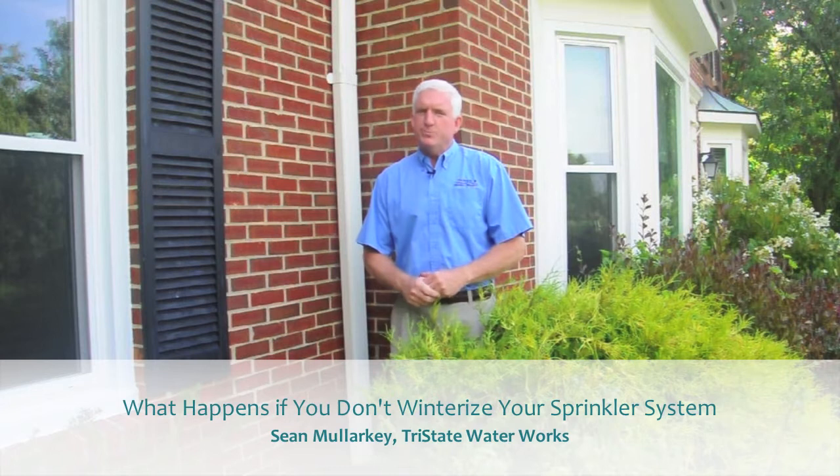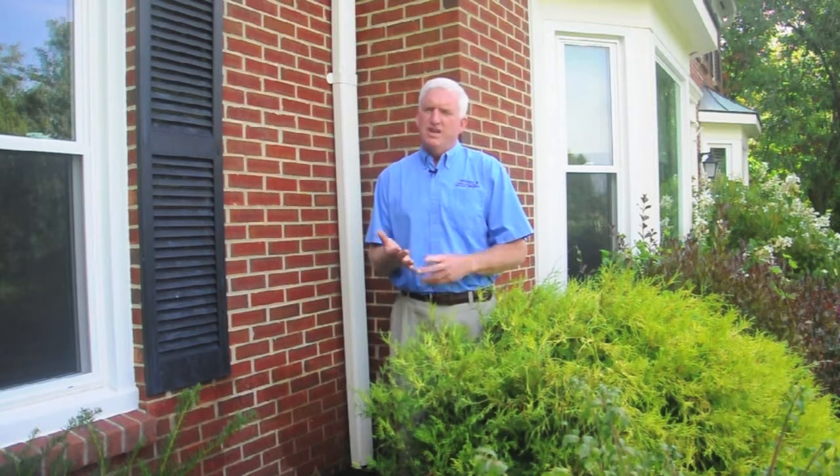Well, it's August, but pretty soon we're going to be winterizing sprinkler systems. And why do we winterize sprinkler systems? It's to protect your investment. On a cold night, even in early autumn, I've seen it happen as early as the 1st of November, we get a night where it dips down to 24, 23 degrees. You can freeze the exposed components of your irrigation system. So the first thing it would freeze would be the backflow. I'll show you what that looks like here in a minute, what a frozen backflow looks like.